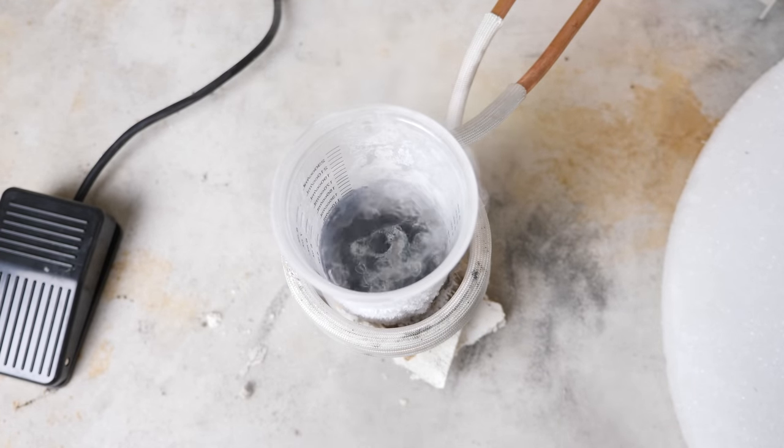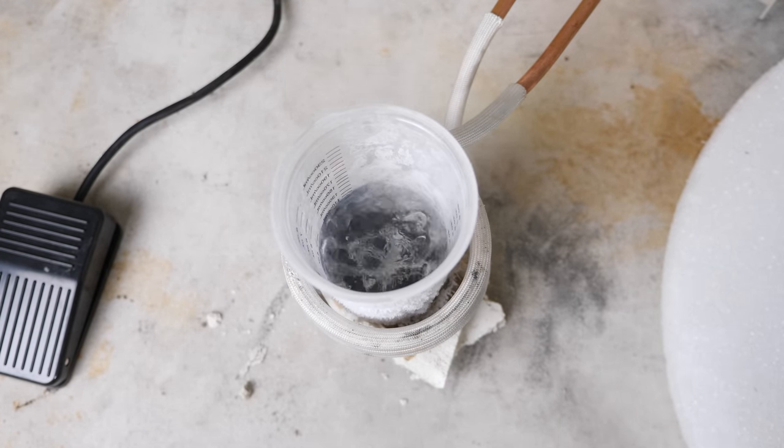In order to tell if we're heating up the superconductor, I'm going to keep it in the liquid nitrogen. So just like with the boiling water, if we start seeing the liquid nitrogen boil more vigorously, that means there's energy input into the superconductor and it's heating up a little bit, causing the liquid nitrogen to boil more. In this way, we can easily see if the superconductor is heating up inside of the induction coil.